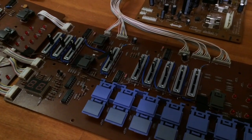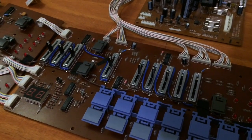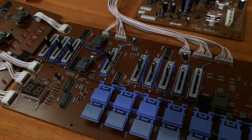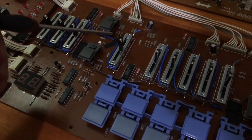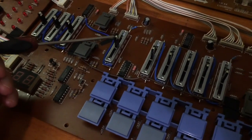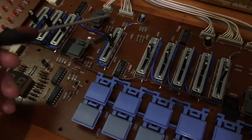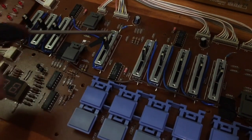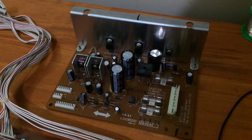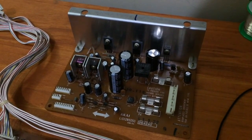So we really do need to take the current down of the standard LEDs quite significantly to get it in the range that doesn't stress out the power supply. Now the only way to do that is to use high brightness LEDs instead of the standard low brightness ones. If we use high brightness LEDs, we can use much bigger resistors, with much less current running through them for the same brightness. So the next question is, where do we get the power from to power the LEDs?